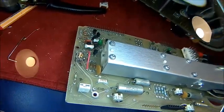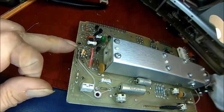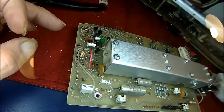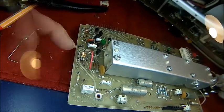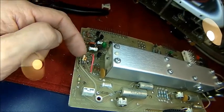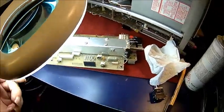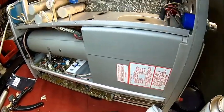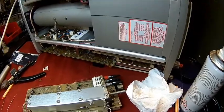Completed repair. It's 22K parallel with 220K — that's about 20 kilohms. And that's the wire bridge. This stays open. These two resistors are actually soldered together on this end, so that's the short on the fully clockwise position. Should do it now, hopefully. Give that a little bit of a clean, put it back in, and just assemble the bare minimum to see if it works.